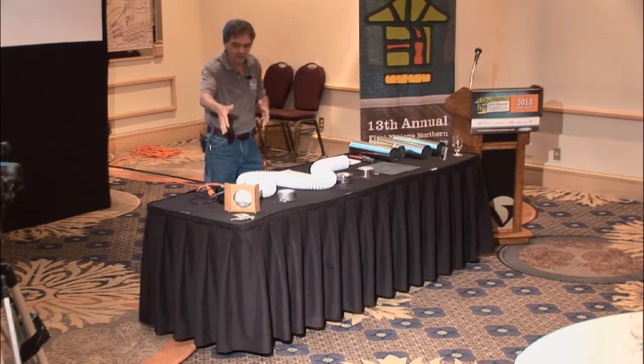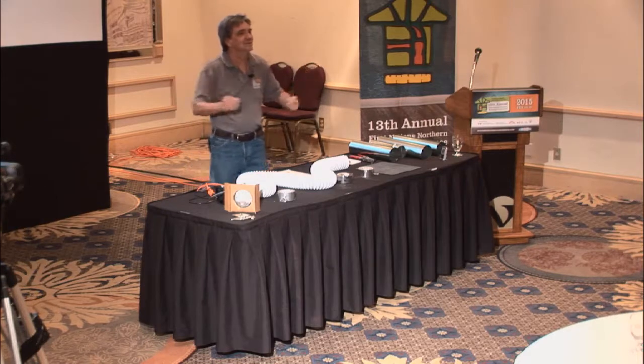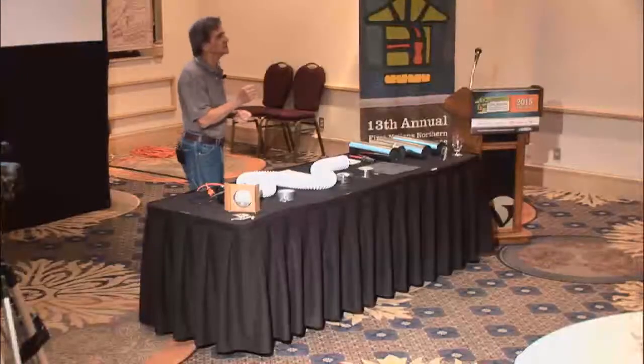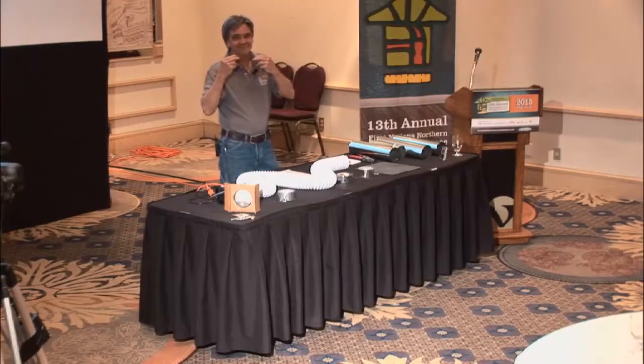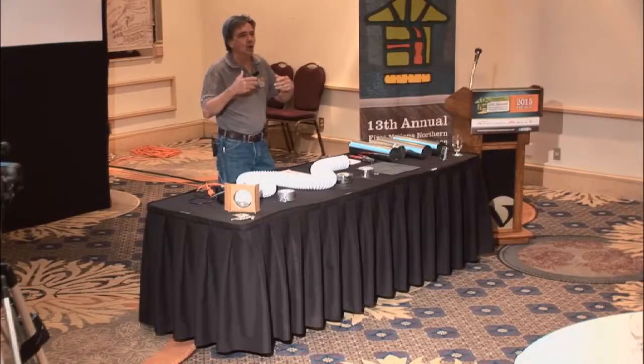If that's the only fan that you're going to get, you might want to see if there's a way to move the fan itself further away, halfway down the duct. So it's not right there. So there's a duct coming in, and maybe you've got a round grill in the bathroom, and your fan motor is halfway to the exit. It works just as well, whether it's right there or on the other end. But you've cut the noise down because you've moved away from the actual turbulence of the fan, and then the ductwork will sort of dissipate that noise to some extent.